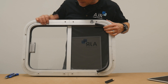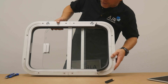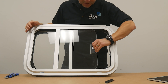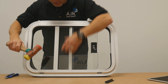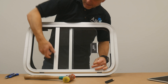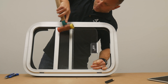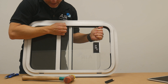The second part is the fixed or the sliding glass piece. Now that your track is out, the sliding piece, once it's opened, you need to use a rubber mallet, or you can use a wooden block and a hammer. We're going to remove what's called a T-bar or interlock — just a couple of quick hits. Once you actually get it loose, this T-bar comes right off.